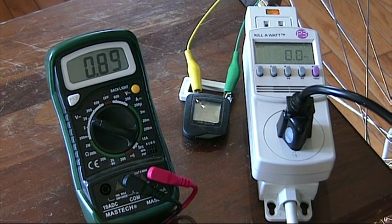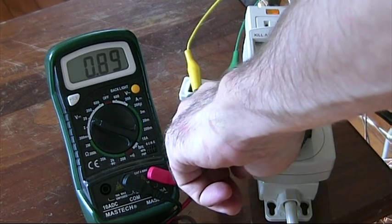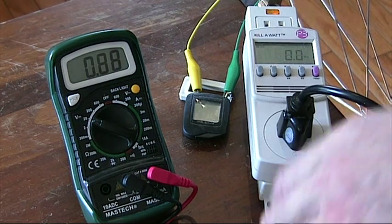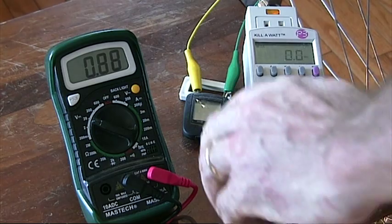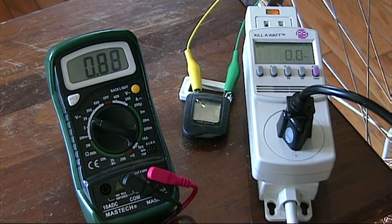What I want to show is how much output is given at various RPMs. In the back, the rotor will rotate at eight RPMs for every one KPH shown on the speedometer here. Once it gets up to about 200 RPMs in the back, the voltage will get a little above 12 volts, which is what the grid tie inverter requires to get started. The output of the grid tie inverter will be shown here on this watt meter. It'll be 25 KPH for 200 RPMs, and about 38 KPH for 300 RPMs.